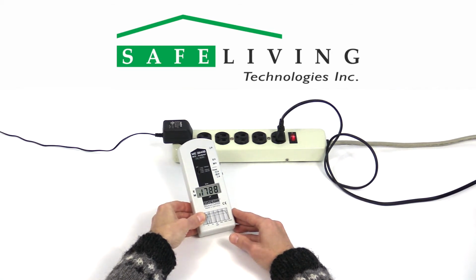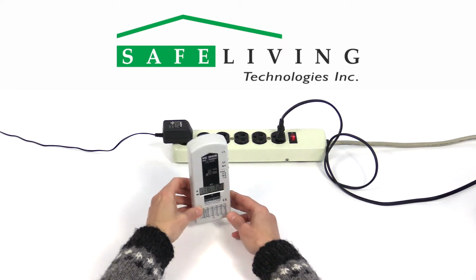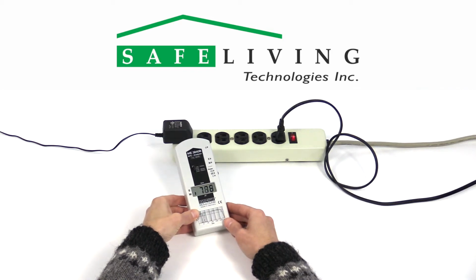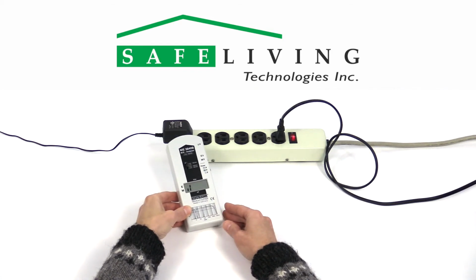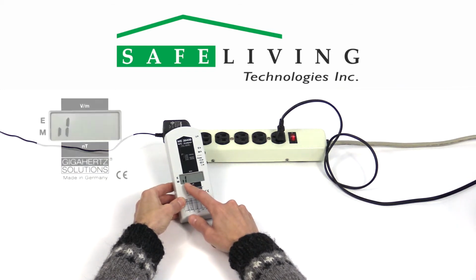After locating the area of concern, rotate the meter in all directions and note the highest reading on the meter, shown in nanotesla. If the measured value is above 1,999 nanotesla, the display will look like this, showing only a 1 on the far left of the display.